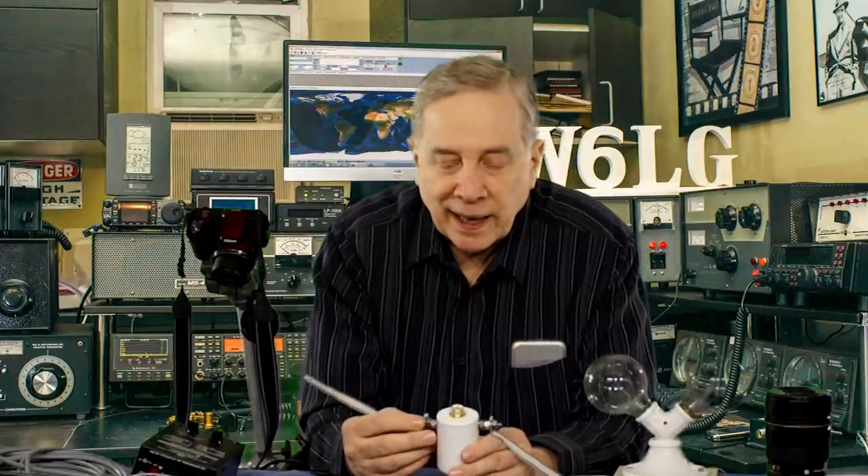What did we discuss today? We've discussed that high current is in the middle on a standard half-wave dipole, high voltage is on the end, and because it's high voltage it's high impedance. At the high current place, that's where most of the radiating is done — not on the ends. Thanks for watching. Please post a comment below. If you've enjoyed this episode, please subscribe — I'm trying really hard to get to 10,000 subscribers. I'm Jim W6LG for Ham Radio Basics. 73, thanks, bye-bye.